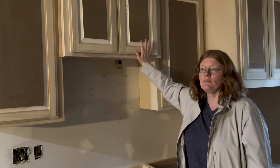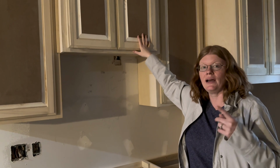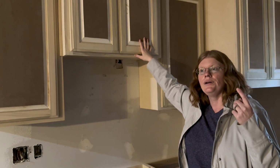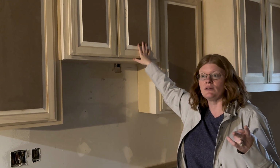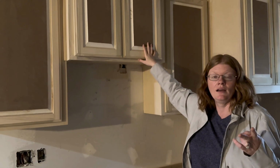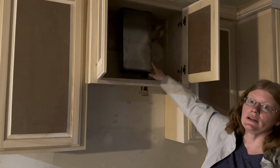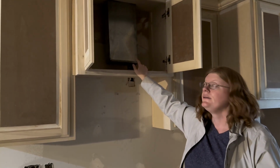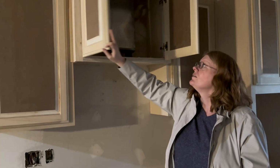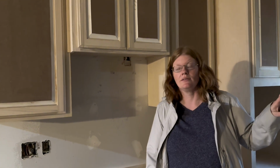I know we talked about the reason why it was originally sticking out was because it's plumbed to either have an external vent or a recirculating air, and with the migraines and the sensitivity to smells, we don't want it recirculating. So we would prefer it to be actually plumbed. So we want it connected to there. And so if we cover the vents, it's not a big deal. So that way it can be vented to the outdoors. Yes. So this is the number 2 thing that'll be definitely happening. That whole area over there about the breaker box, we have to decide on.